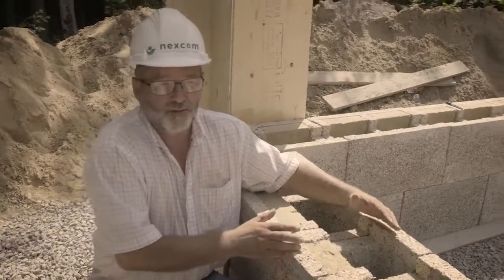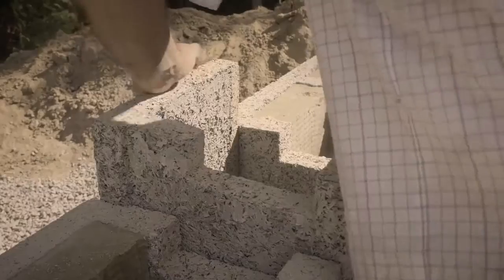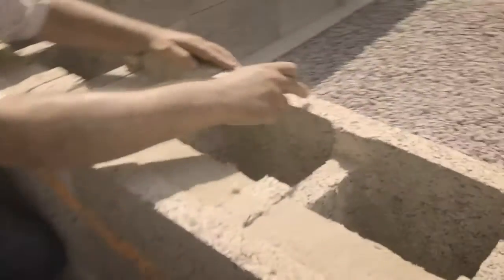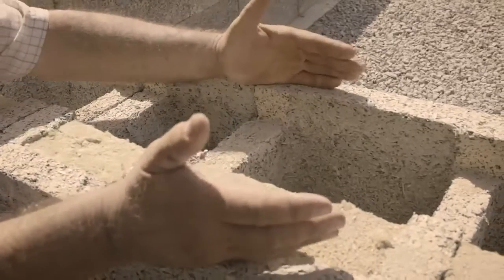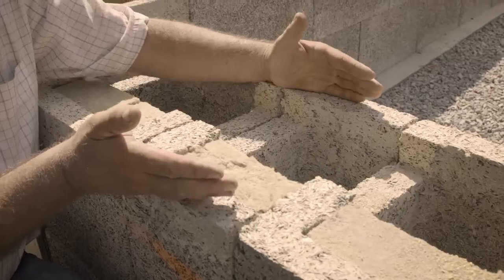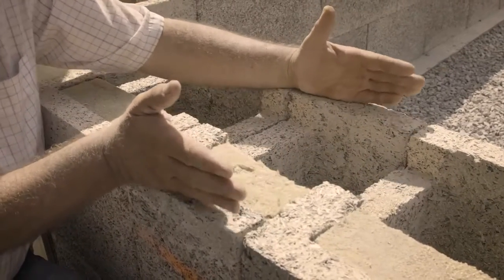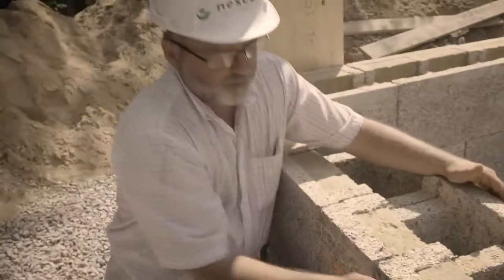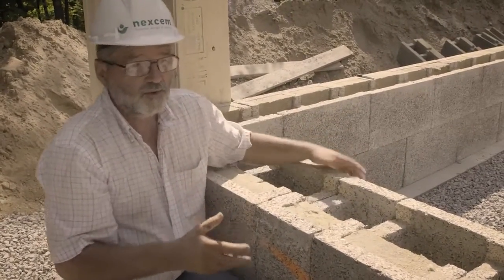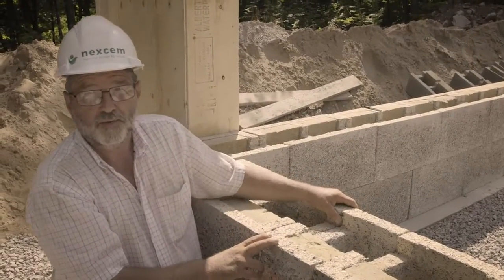This is one of the important things where we can actually run the risk of a blowout, and we have to pay attention. What can happen is we've lost the integrity of our cube. You can see in this one that we've got a cube shape that holds the concrete when it's pouring in. But here we've cut that piece out, so we've left lots of room for concrete, but now we have the chance for this wall to spread. We'll put plywood screwing it across here and across here, and we'll do that once our wall is up at the 10-foot mark and we're getting ready to pour — it's one of the last things before the pour.